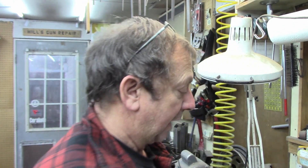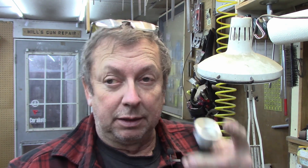I'm going to extend it a little bit farther out and adapt it for hex dies. The reason for this is it's a big enough part that it has to be turned on the Sheldon, and I don't have a die head set up big enough to handle these. I've got a little sketch — I'll show a couple of other different ways to run taps or run threads. One option would be an acorn style die, which I actually like better than this style.